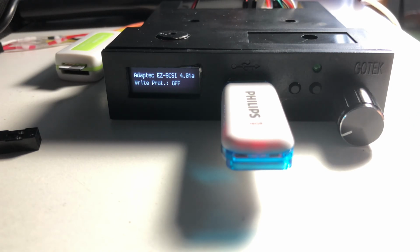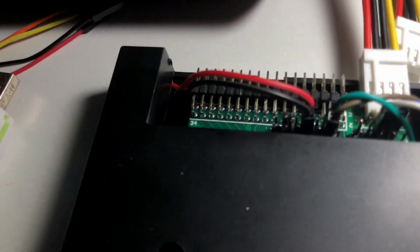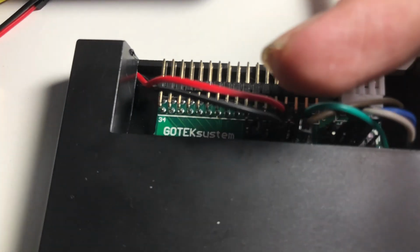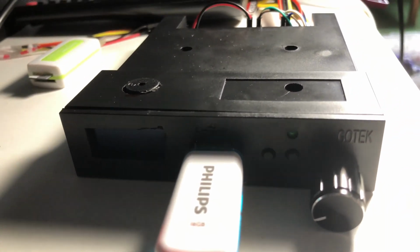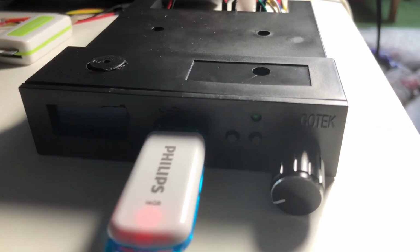Because you have to connect the ground to another pin on the rotary encoder. As for the speaker, it shouldn't matter, but I have put ground on the side of ground. That's the left side right now, as seen from this. So the downside, as seen from the video, and the plus side there, and the screen as well. It has a polarity, so you need to be sure, check everything twice before using glues or anything that will prevent you from going back and fixing a mistake.